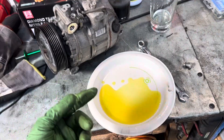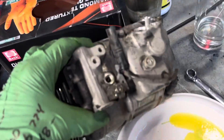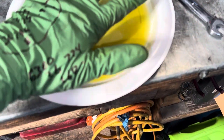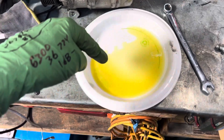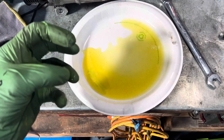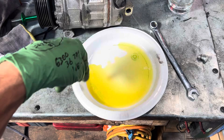This is a follow-up video on that Mercedes compressor. This is all the oil that came out of the oil drain plug right there. You can see it bubbling like Coca-Cola — see that fizz? If I were to put this into a beaker and pull a vacuum on it, this would foam up and almost fill the entire glass. It would become a foam because the refrigerant is impregnated or bonded in the oil itself. If you lower the pressure on it, it'll just expand like a great foam.